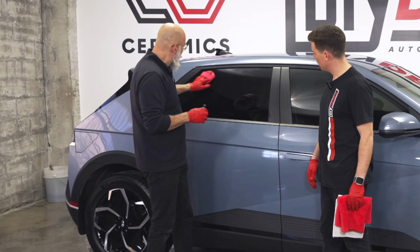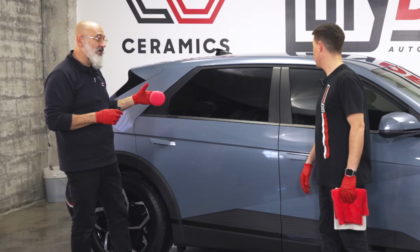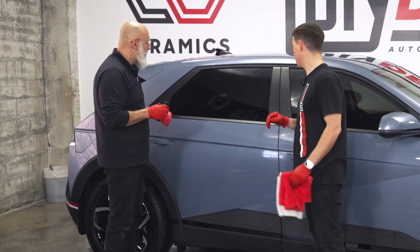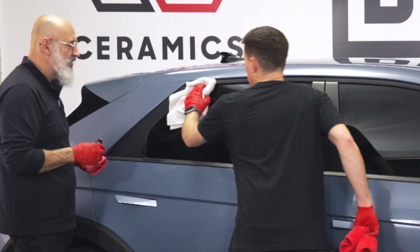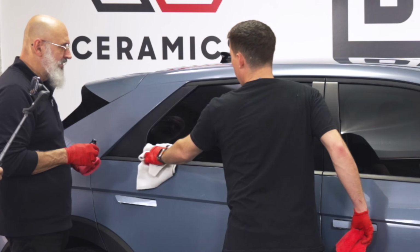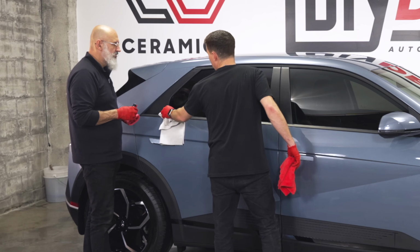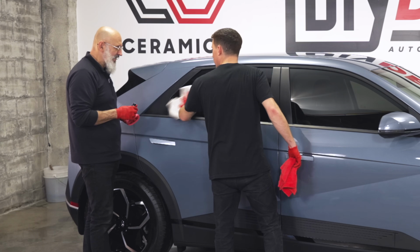And what this is doing is telling us, okay, well, it's quite humid in the shop today, so the cross-linking is quick. This is more of a test for you, but also a demonstration on camera of exactly what it's gonna do. Exactly. And now you can level, since about 50% of it has gone to clear, so we no longer have that oil slick on water look. And with plastics and glass anyway, it's a little quicker. Yeah, even if I'm not seeing that humidity and watching it flash that quickly, right, we're wiping quicker. Exactly. Am I wrong there?